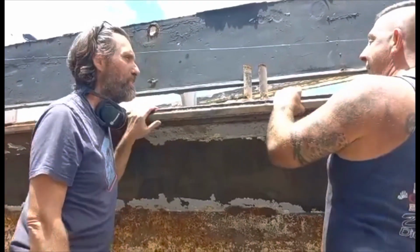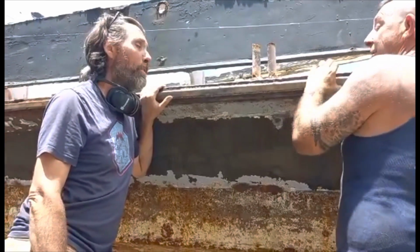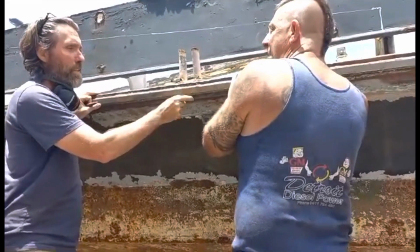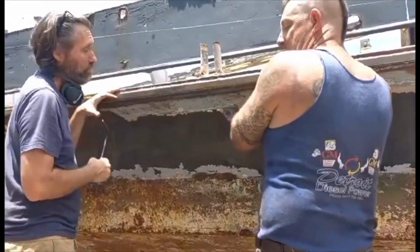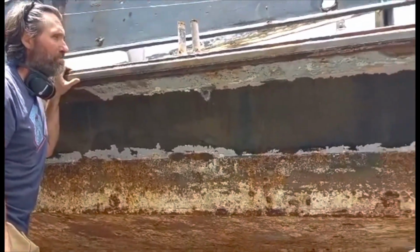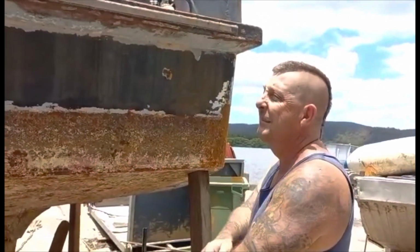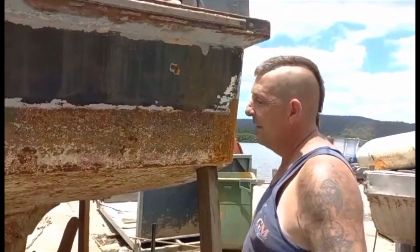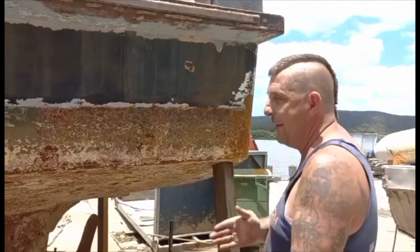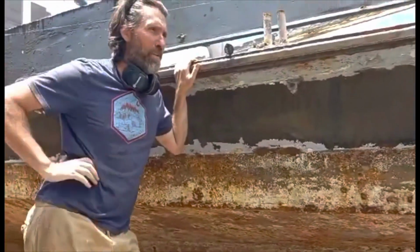Well, maybe what about a bit of, like, 4 mil and get it folded, like a suit. You could. Yeah, and maybe not even see, like an angle. Yeah, so like just 3 bends. Yeah. Not out of the question. That might be easier than trying to cut a tube. Talk to a steel guy. Yeah. Because those that can put the tube in the guillotine, like, no. It'll be a bandsaw type. Bandsaw or water blasting cut. Yeah. Like a real high pressure. Yes.